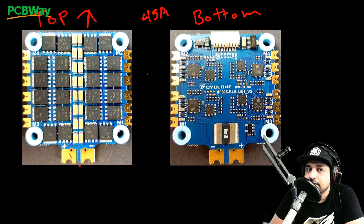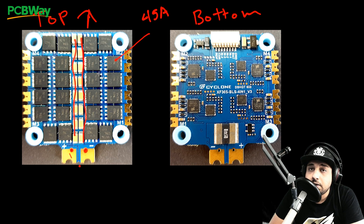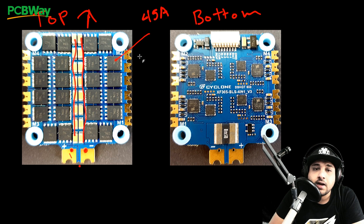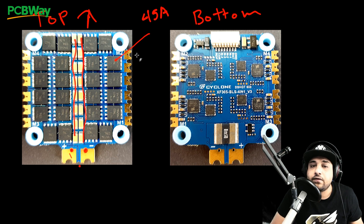Now for the advanced breakdown of the 4-in-1 ESC: first let's look at filtration. The filtration is in the lower range and I definitely recommend adding a low ESR capacitor whether you're running a 4S or 6S build, since this ESC takes both. The design does give you two holes to insert the low ESR capacitor, making installation much easier. For MOSFETs, they're using Toshiba FETs — anything starting with TP stands for Toshiba — so it's a well-known name brand, which is great to see. They've also done edge plating, which is a more expensive process where you can see copper on the edge side, increasing the copper area and allowing more current flow and power delivery.